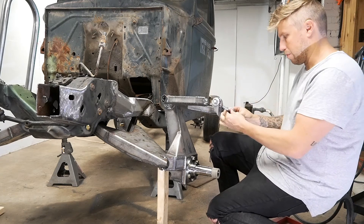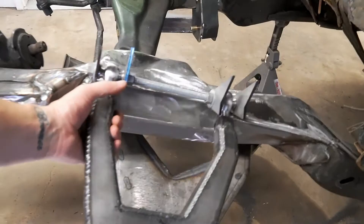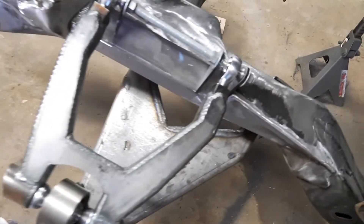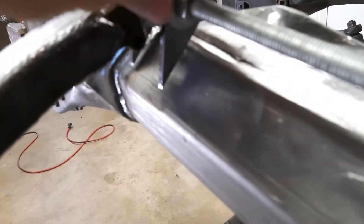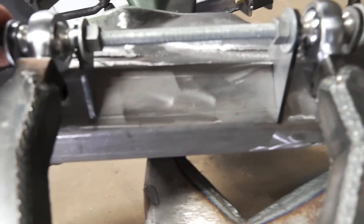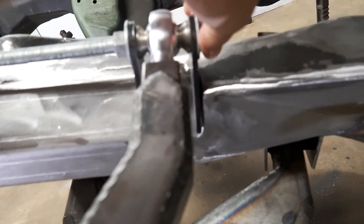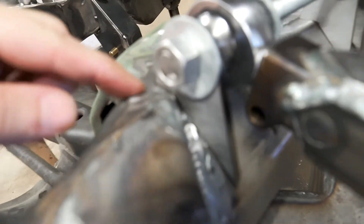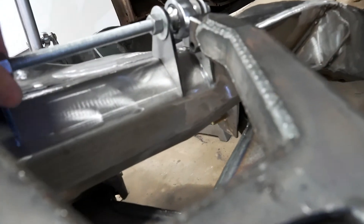Make sure your heims are just right where you want them. So then just flip this over and all these tabs go on their way. You can see this back one is almost perfect. What this threaded rod does is just kind of hold everything in place — you want it tight but just hand tight, you don't need to tighten it down with a wrench. I'll just check these clearances — some of these aren't exactly perfect, so I'll just grind those to fit. This one's way off because it's touching up here, so I'll take a little bit off this and a little bit off the frame, then get that perfectly on there and tack them in place.